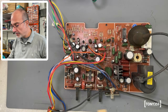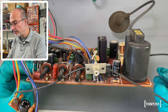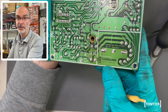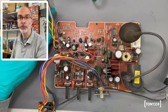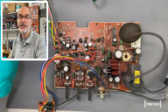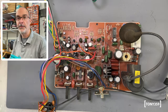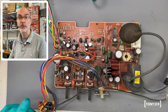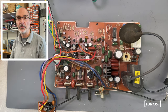I don't see anything obviously wrong on this board. I can see that the capacitors are branded Samsung — and I was totally right that this is a Samsung monitor, as even the board says Samsung. I haven't checked but I think the CRT is also Samsung branded. I don't want to recap this board just for the sake of it — it's never a bad idea, but on this one I just want to make sure it works. I'll remove a couple of these capacitors, test them, and see if they're in good health.